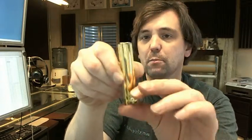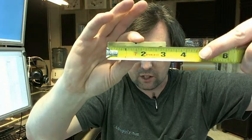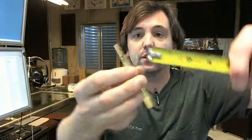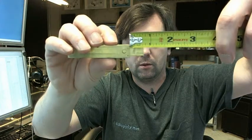The '3' part of the part number means that it is 3 inch, and 3 inch is reference to the length of the body. There is a link below this video to the cut sheet, so we won't go over every single dimension. Per the cut sheet, the 3 inch means that you are going to have a B dimension of 5 eighths, and that is the projection — 5 eighths projection, obviously a little bit more than there.